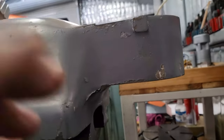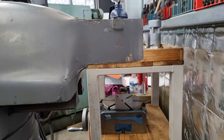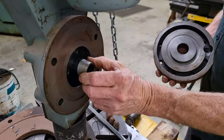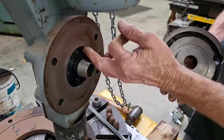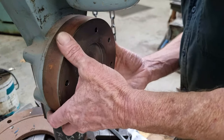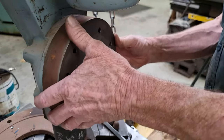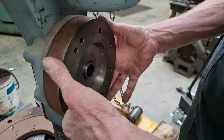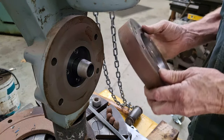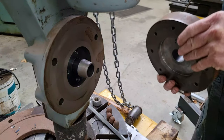What we've got to look for is that it's not too long and fouling in the corner underneath. Looking at this, I've separated the adapter — this part does nothing. The adapter seems to register quite neatly on this diameter here, sits on there rather well. That protruding bit does nothing, which is a good thing. This is marked with degrees around the outside so you can set the head to whatever angle you require. Let's look at our bracket.